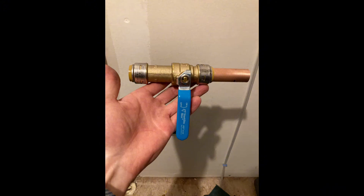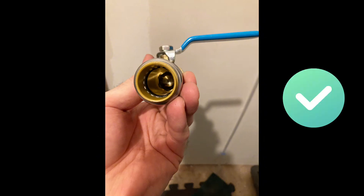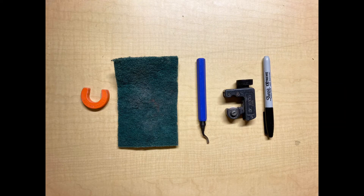Once you get the other side of the ball valve lined up with the other piece of pipe, you simply slide the ball valve up onto the other pipe into place. These work great for tight, confined spaces or in a situation where you need to add a ball valve and you don't want to solder or can't solder, and the pipe doesn't have a lot of give or ability to move. Push-to-connect ball valves are also plumbing code compliant.